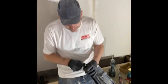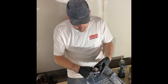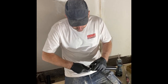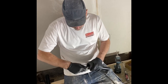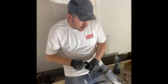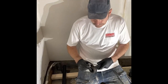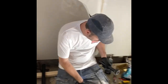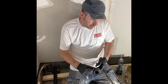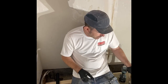So when we're doing these and you're pushing these bushes in, you have a lip of rubber which goes over that and you don't want that. So chamfer it round, and then a bit of lubrication on that and it'll push straight into that joint there. And then if you want, because it's underneath the floor, use some wet tape round it. And you know for a fact it'll never pull out and never move.